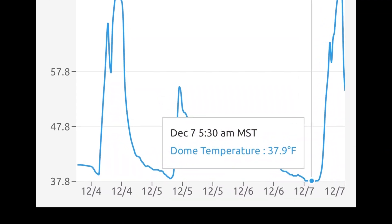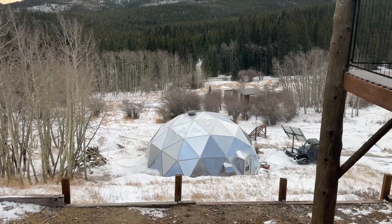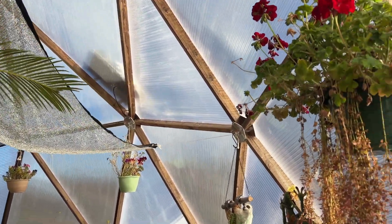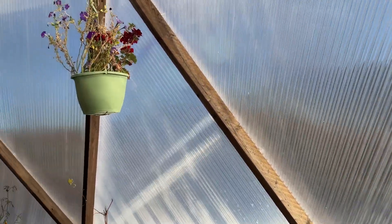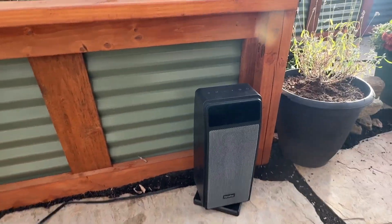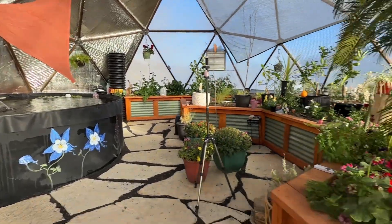Going back to temperature, the coldest it's been in the dome was down to 37.8 degrees at 9 p.m. after several overcast days in a row. I was nervous to see it drop any lower, so I turned on the system fan for the climate battery. You can see a slight bump up in temperature until about midnight, then it gradually drops a few more degrees but maintains the dome above freezing. I'm learning to turn on the underground air fan when the dome temperature is at 40 degrees or less at 9 p.m. We do have one insurance policy — a small space heater, which we've only used a handful of times, because I'm still learning how good the air transfer system is and don't want to lose everything without a backup.